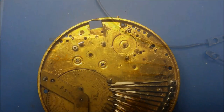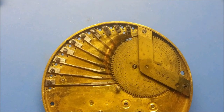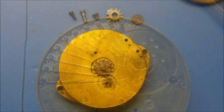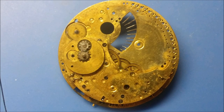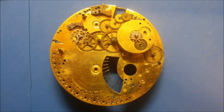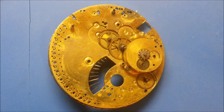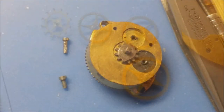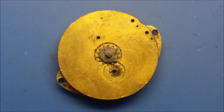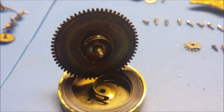This is helpful not only because we know what parts go where when it comes to reassembly, but it also helps you figure out in what order the watch should be reassembled. Because in a watch that is as complex as this one, the order in which things go back together really is important. For a complete disassembly, we also want to take apart the mainspring barrels and photograph these so when it comes to reassembly you know which way the barrel hook is supposed to go.